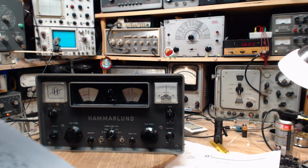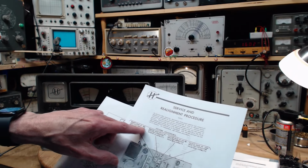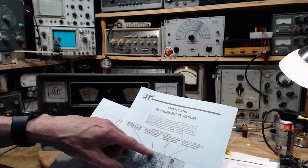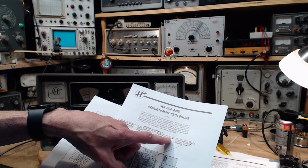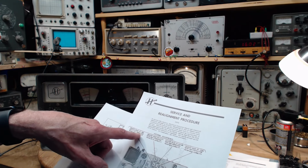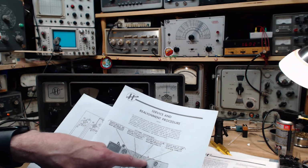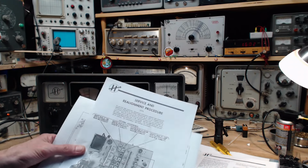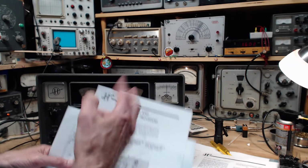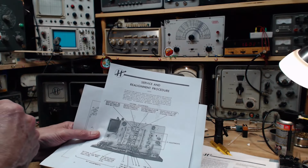Okay, one more adjustment here for this band, and that's the antenna adjustment, which according to this chart would be done. This is 1.2 megacycles. This is 1.65 megacycles. 10. 4. These instructions are really weak at this point. They didn't say what band. 10 megacycles appears in two bands. At the 4 to 10 and the 10 to 30. So which one is it?